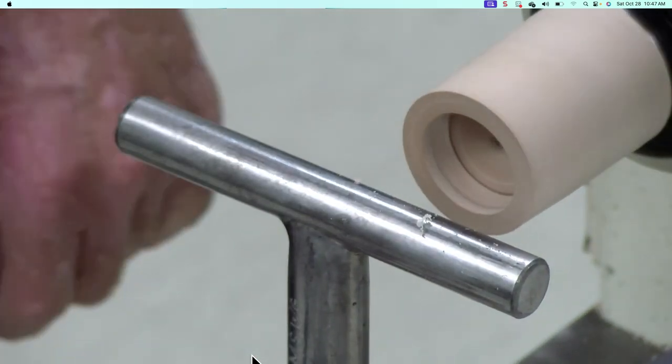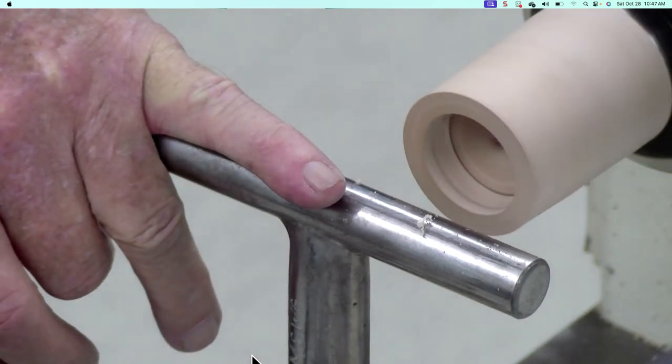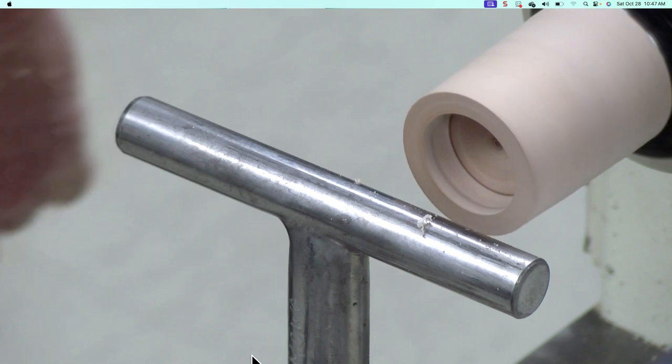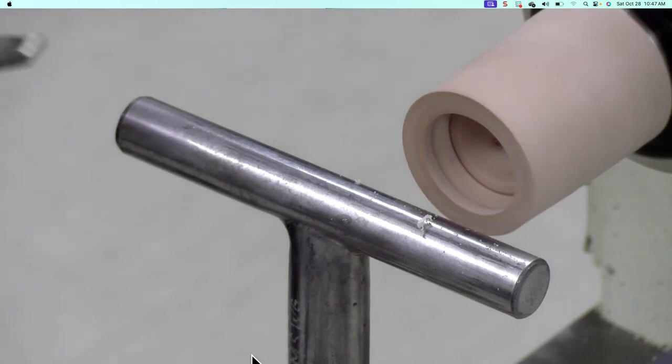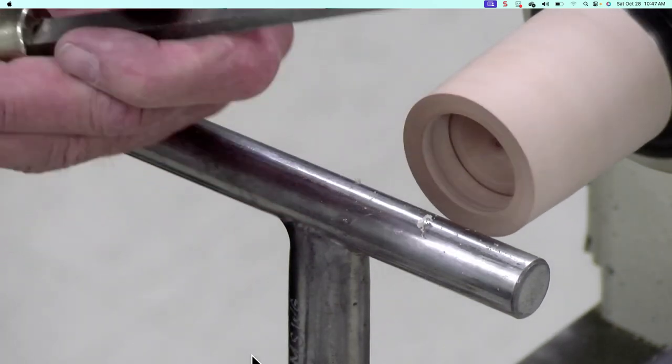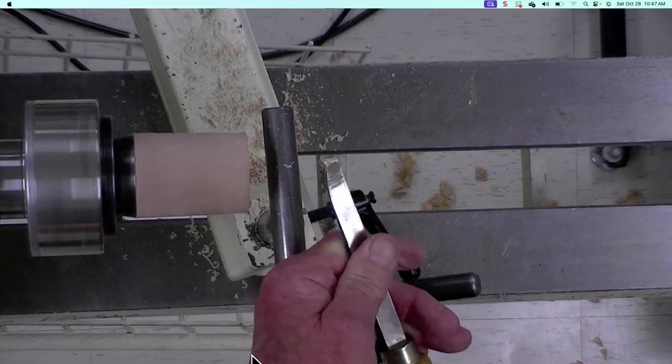Now, before you thread, and you want that bottom cleaned out, now's a good time to do some sanding in there. Now what you want to do is make that, remember I told you that recess? You should pull your tool out before it hits the wall. This is what I'm going to make it with. Can you see the profile on that?